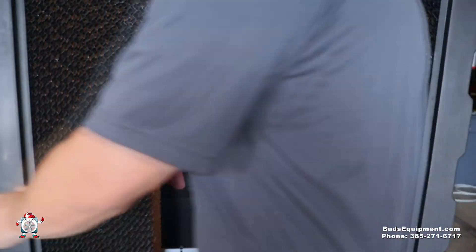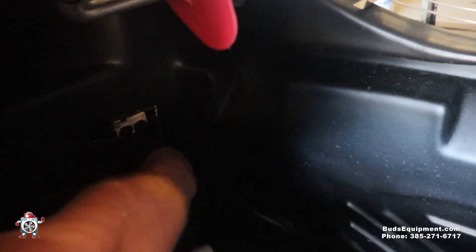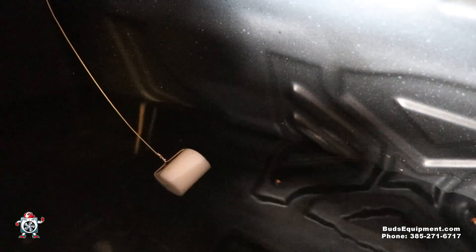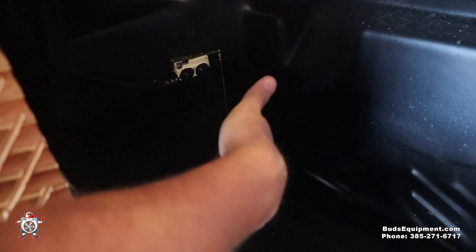Now I'm going to show you the light and how it's mounted to the plumbing. The indicator light shows that it's on. It has a proximity switch on a floater — when the tank is full of water it floats and turns the water pump on, but if it's out of water it turns the water pump off. This is important because if the tank is dry and you don't have that feature, like our competitors, you're going to burn up a water pump, which is costly and time-consuming to replace.